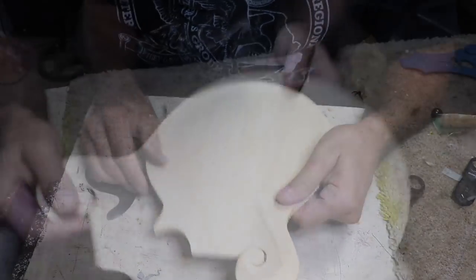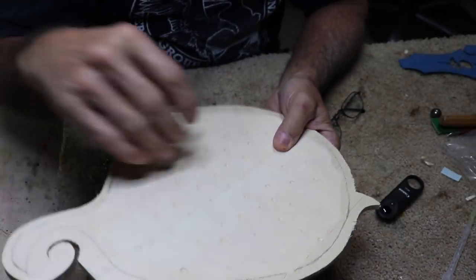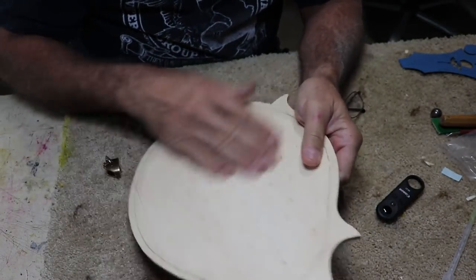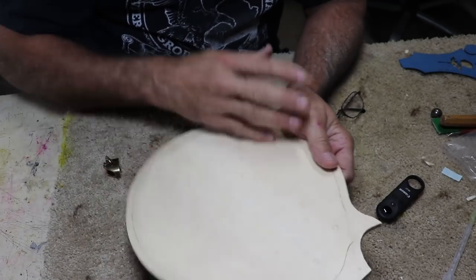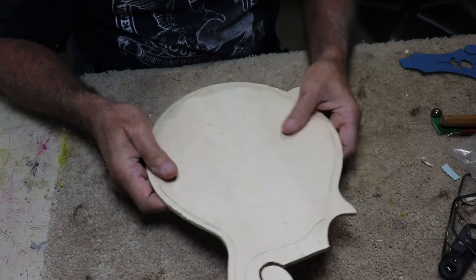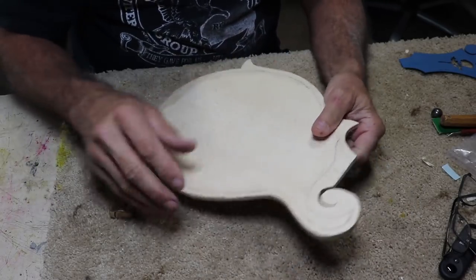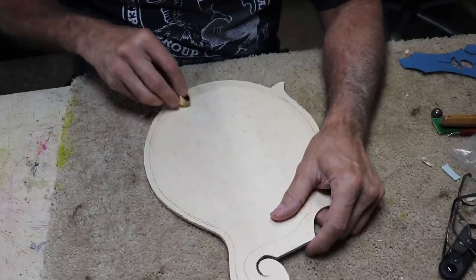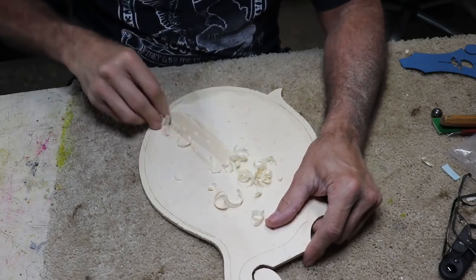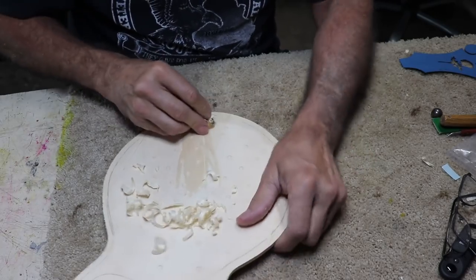It's pretty good shape. As you can see, I drilled a bunch of holes in this, and I had a depth stop on my drill press, and I drilled them to a thickness that I know was plenty conservative. And then I took the hand grinder and I ground down to where I could still see all of the holes. None of the holes disappeared, and as long as I can still see the holes, then I know I'm more than thick enough. So I'm in very good shape here, but that did get rid of a lot of wood really, really fast. And now we're just into the hand carving thing again. For the most part, I'm just going to go ahead and take everything down to where the holes just disappear, and then we'll start the detail carving.